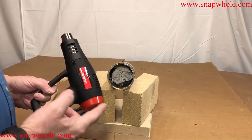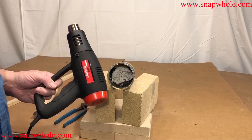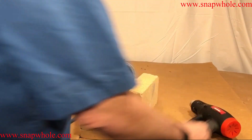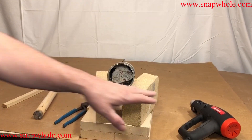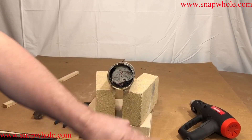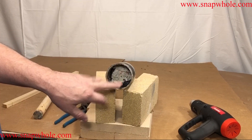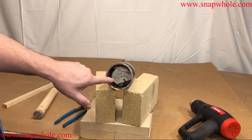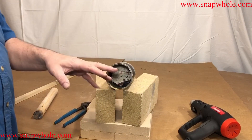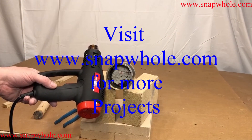There's the answer to my question: will the DrillMaster heat gun melt HDPE from grocery bags? Yes, it will. Takes forever and a day, but the heat gun is melting it just fine. You actually don't want more heat than it's putting out because you could burn and scorch the plastic. Better to leave it like this — keep compressing it over and over again until you fill the can. Then you have a nice big mass of HDPE to work with. If you like the videos, please subscribe to my channel.